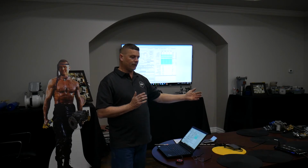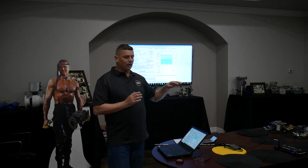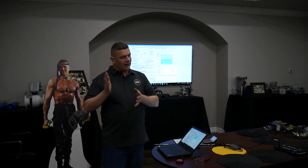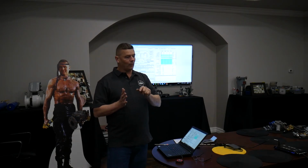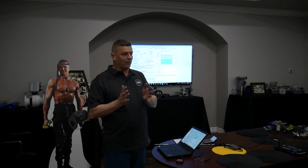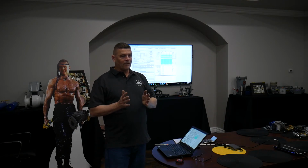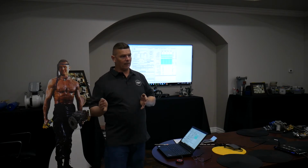I'm going to make my pressure cut to 25, but my monitor is at 30. So if I put my monitor up front, it sees full inlet pressure, and if it has to become the worker, it's going to be controlling at 30. So that's what I'm worried about. My critical point is what the monitor has to have. If it has to be the worker, I probably put it up front in that situation, so it has full inlet pressure to work across that differential.